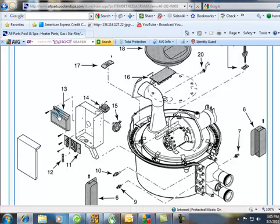But anyway, to determine if it's a blower, what I would do is make sure your power is off. And again, I will send you a link to meters I like. You want to make sure that this section, where the whole blower unit is, is totally off and has no power. And what I would do is jump F1 and F2, the wires together, completing the circuit to that particular blower, and the blower should turn on. Now, I'm not saying this blower's not turning on because of other problems. You've got to make sure your grounds and the wiring are good,